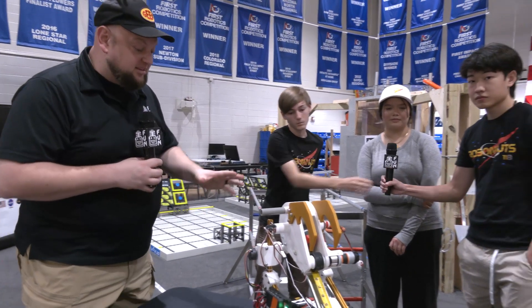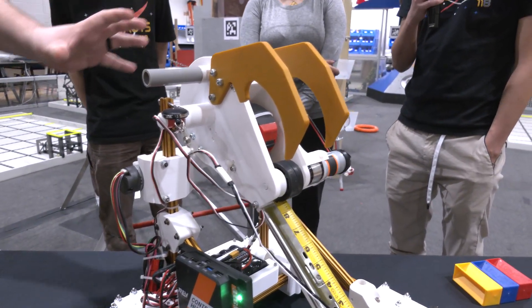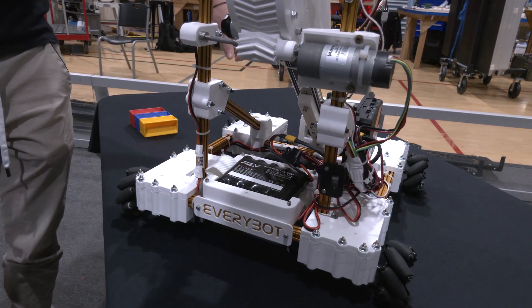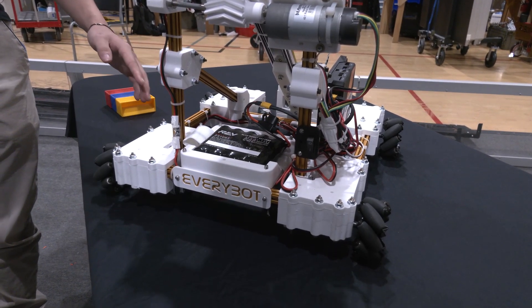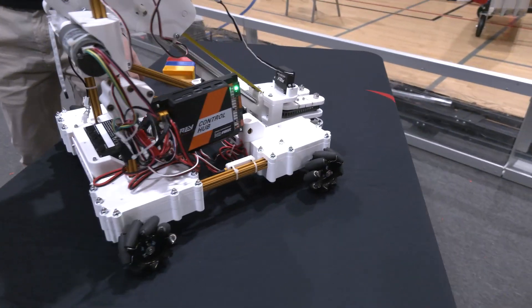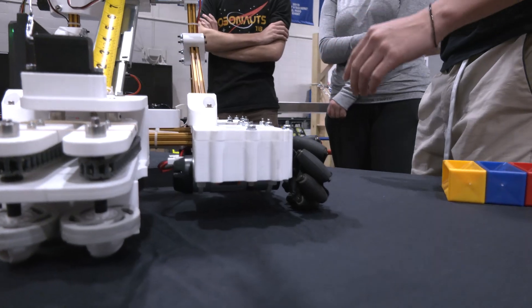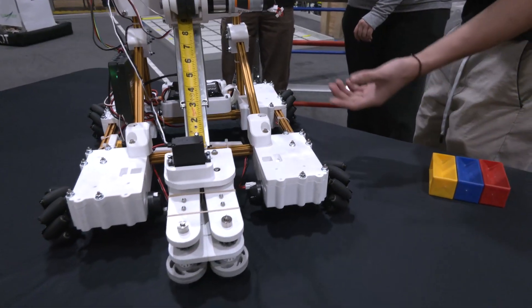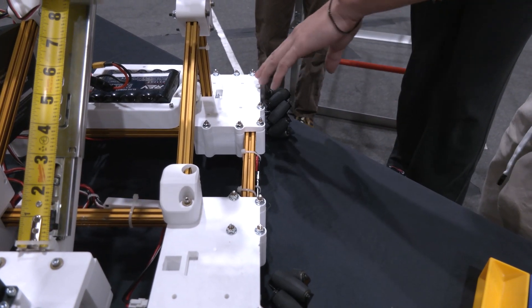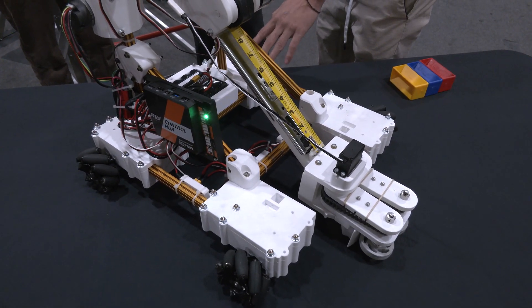Jackie, let's break down this clamshell design — very accessible, functional, and durable. We wanted to create something that does not require accurate cuts on the aluminum, so all cuts are made with a handsaw and the faces don't need to be perpendicular. All 3D printed plastic parts require no supports — we've implemented tricks like teardrops for holes and chamfers instead of fillets to make the printing process as easy as possible. We can also change the diameter to adopt many different styles of tubing, and overall it's modular so teams can choose to expand.